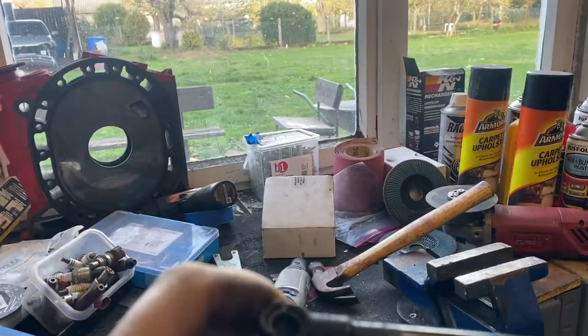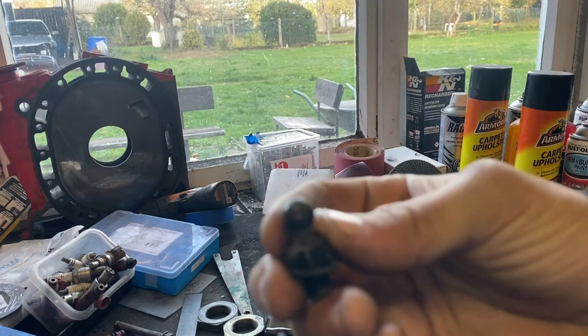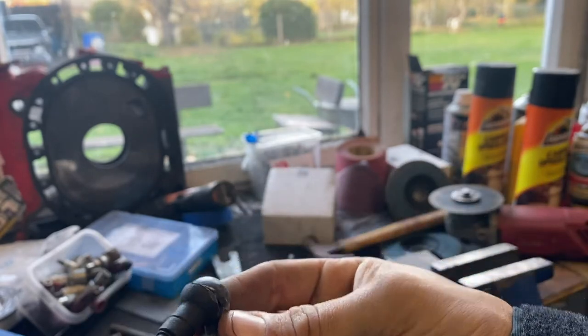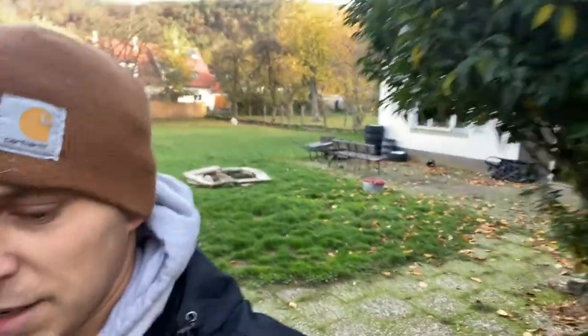All right, just like that. So all I did was literally make a little cut around it and then I hit it with a hammer and knocked it right off - pretty simple. No scoring or anything on the ball. The ball hangs down a little lower in here, so just take your time. Don't cut it like a crazy man and you'll be good. And honestly, if you do nick it a little bit, it's not a big deal - as long as you don't cut the ball completely in half, you'll be all right.